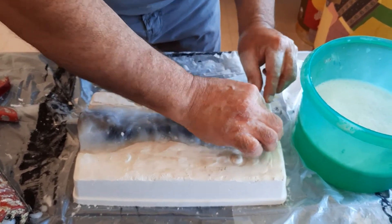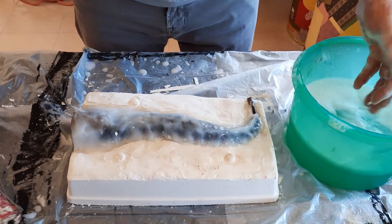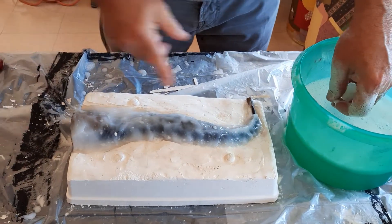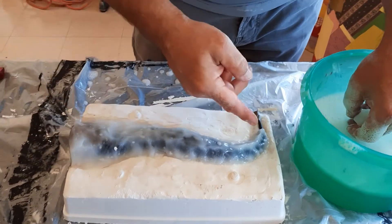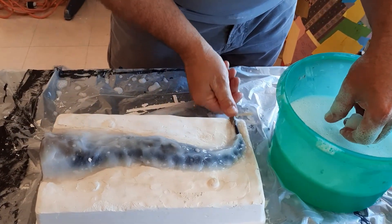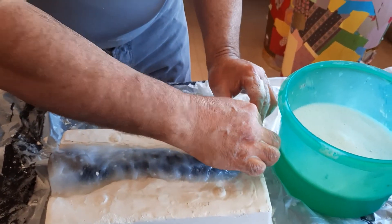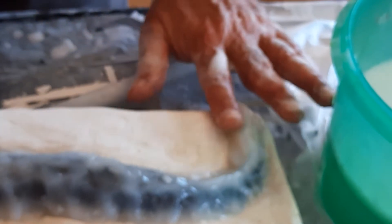Just keep pushing it down the mold. You'll notice this plug down here — that's so I don't get an air trap down here. When I pour a product in and it flows through, I put a plug and that'll stop it, but I'll get all the air flushed out. Otherwise you could end up losing the end of your piece. So make sure you put an air vent.